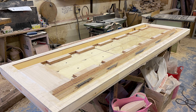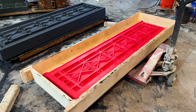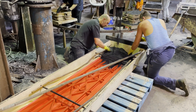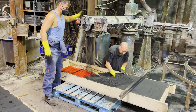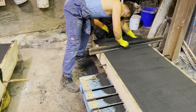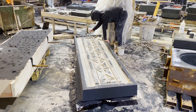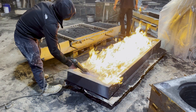The pattern was very precisely carved in timber and took 148 hours to create, accurate to ten one-thousandths of an inch. The pattern was sent to Trent Castings Limited at Mansfield, where it was used to form sand moulds into which the molten iron would be poured to make the new cast iron panels. This is exactly the same method that the original craftsmen employed to make the lamp standard cages over 200 years ago, and exactly the same levels of craftsmanship and care were employed in making the replacement sections.